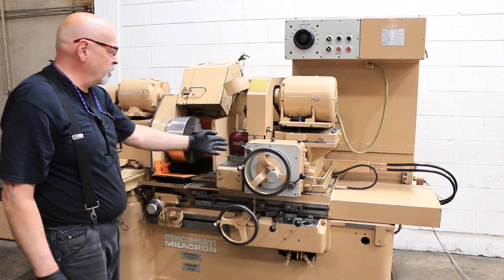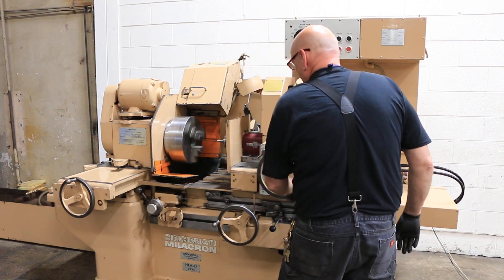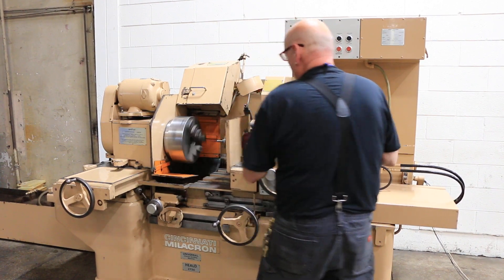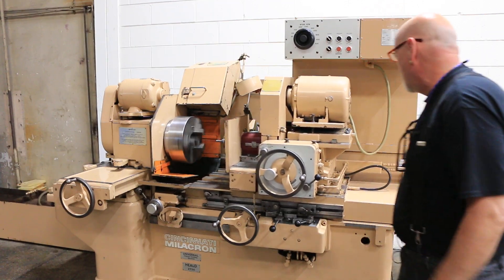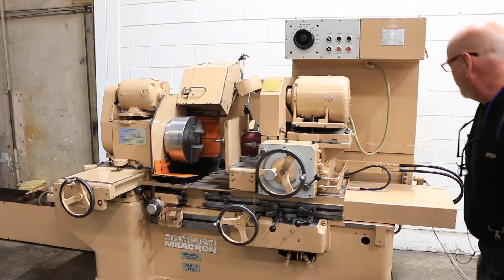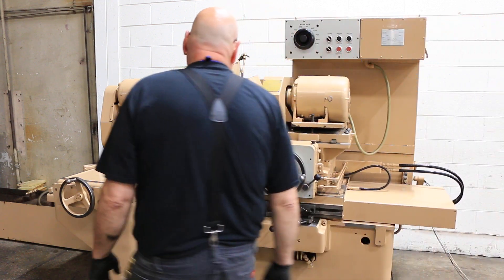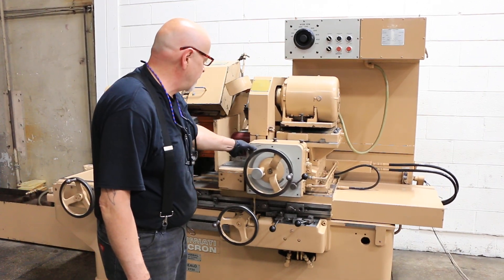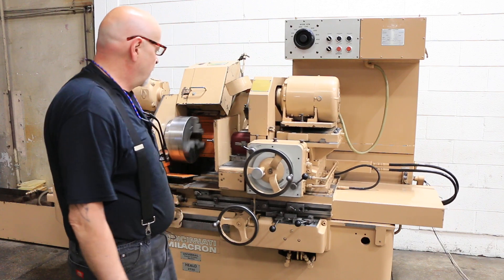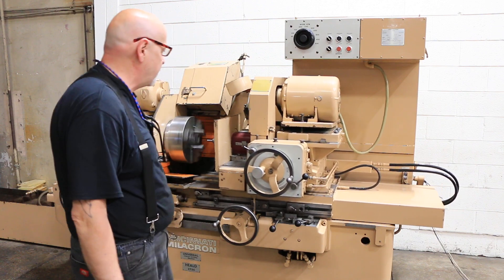This is actually your infeed. You would use this to come in and move — you're actually moving your spindle in and out with this hand wheel here. This whole slide is also floated on a bed of oil, a hydrostatic way. You can adjust here how much it feeds each time. You've got a fine feed dial if you want to feed this thing in by hand or back it off a little bit.